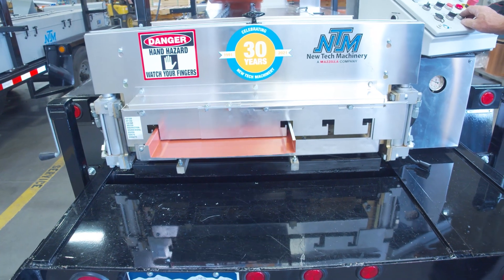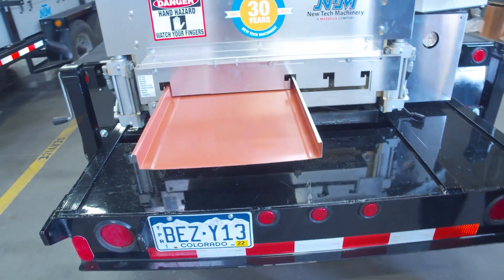With polyurethane drive rollers, you only need to make minor or no adjustments at all when switching from material types or gauges. Urethane is a softer material and more forgiving than steel, so you don't have to keep material loaded in the machine. At New Tech Machinery, we've been using polyurethane on our drive rollers and keeping both components separated in our equipment for many years. It has proven to be the best material and method available for a portable roll forming machine to get the best quality end product, for the longevity of your machine, and for easy maintenance.